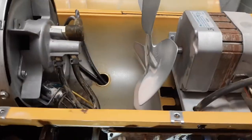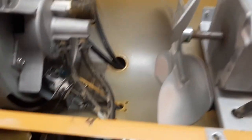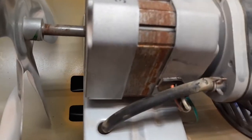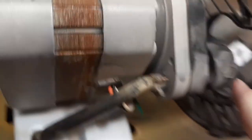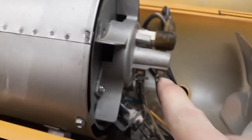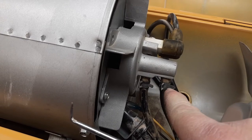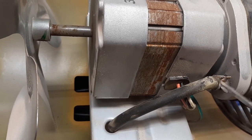So we're not getting ignition. The first thing I do is look at all the fuel lines and air lines to make sure there's no cracking. What I noticed on this one right off the bat — you can see right in here we've got some cracked lines, and there's actually another one right here. So even though we're getting good air pressure on the back side, we may not be getting enough pressure through to the nozzle in order to ignite. The first thing I'm going to do is pull this line loose and cut this small section off and reattach it.